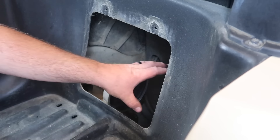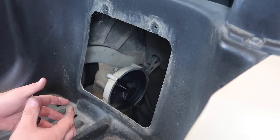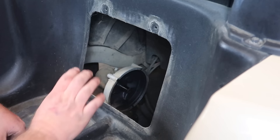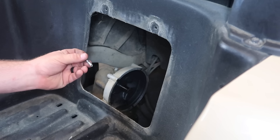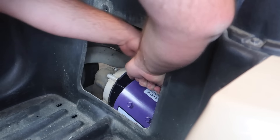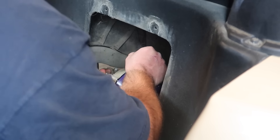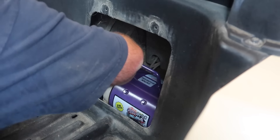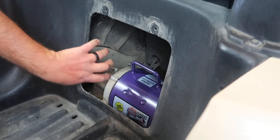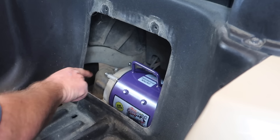We're going to slide the motor through this opening and place the female shaft onto the male shaft of the rear end. Once we have the motor sitting on the rear end shaft, we're going to take our mounting hardware and rotate the housing of the motor until the male threads drop into the female threads, then tighten them down. There is a slight gap here — we're not going to compress the motor with the mounting bolts. We're going to continually rotate and rock the motor back and forth to eliminate this gap before we tighten the bolts.